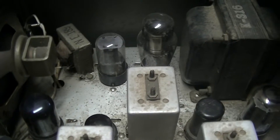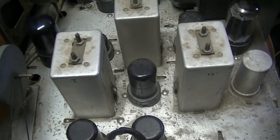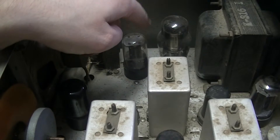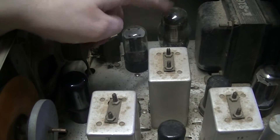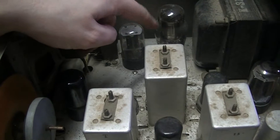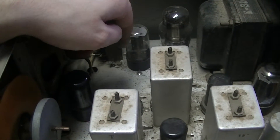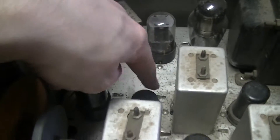This is the tube compartment, and this one actually has all its tubes. The potential regulator tube right there is a very interesting tube — when the radio is operating it glows purple because it's an argon-filled potential regulator that basically functions as the hollow-state equivalent of something like an avalanche diode or Zener diode. Then there are more metal-case tubes, and a little tiny 6H6 there.